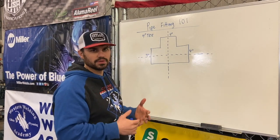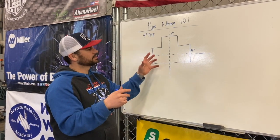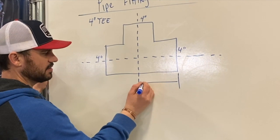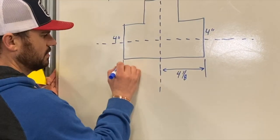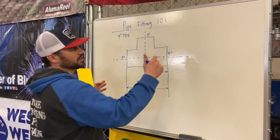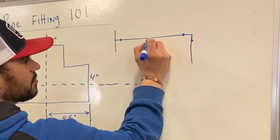To my knowledge, there's no trick for figuring it out. One of the things you need to be aware of when you're laying out your piping and doing takeoffs for T's is: on a standard T, this center line — the T is measured from the face of the T to this center line here. In the blue book, it labels this as four and an eighth. So this fitting takes off eight and a quarter inches. If you've got a flange, then a T and a 90 — these are one-line drawings, just like we showed you how to do — these are the welds.